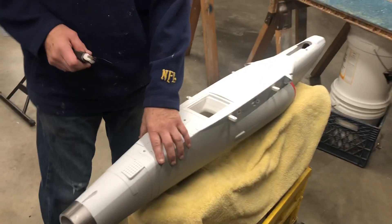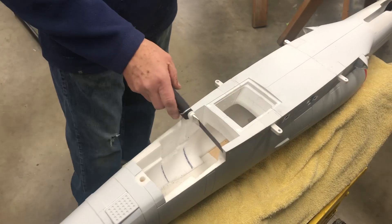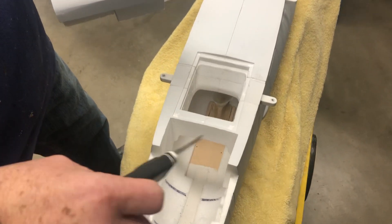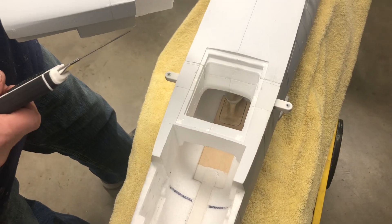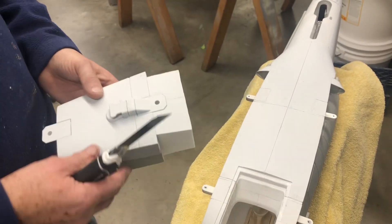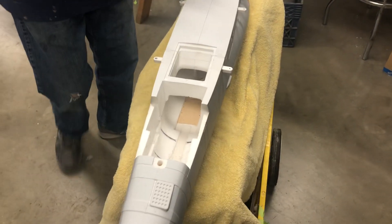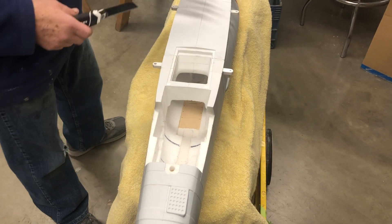The first thing I did is the hatch used to stop right here. So I cut out a chunk about an eighth inch away from this line right here with a slight angle to allow the parts to go in a lot easier. Then I glued that piece onto the hatch, and basically that's my access hatch now to get the engine in and out. I know this freaks out a lot of people when I do this.